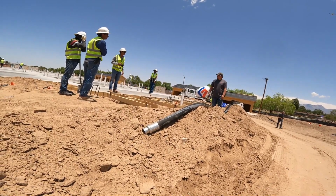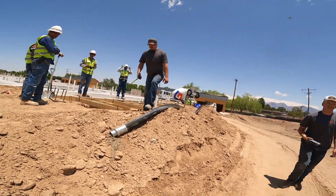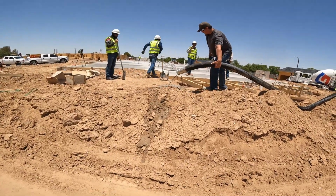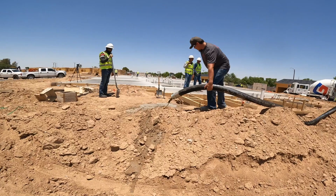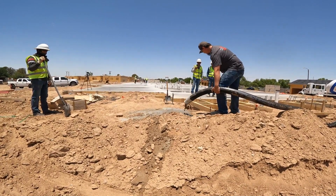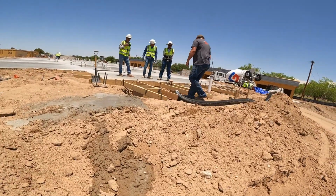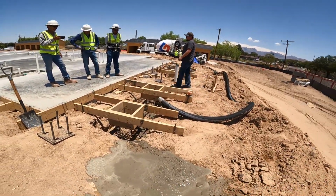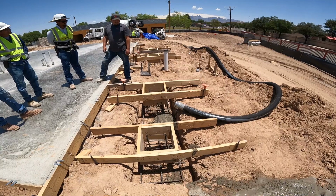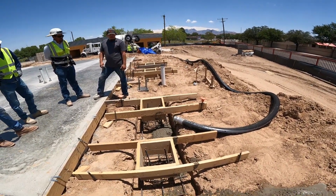No, I'm at 50 right now. So I can just feel it come through here. It's about the time. Is it really? Already? Still working air out, huh? There's still air in the hydraulics, yeah? Okay. Now check your hydraulic oil and the level of the skids here. And right now the skid steer ain't turned up either. I slowed the throttle out. That'll change some too.